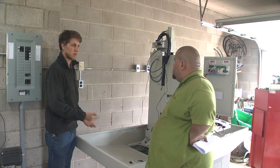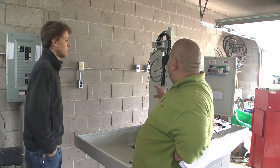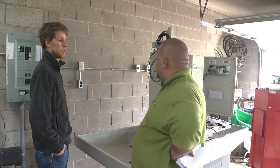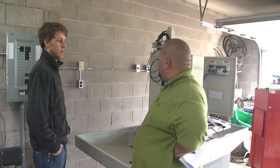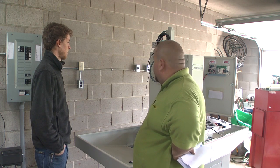Is there anything special you have to do for this machine or for the plugs? Well, for the CNC, the machine's always by itself — it's 240-volt, 20-amp feed — and then you need 120-volt to run the computer. So you put those on separate circuits.